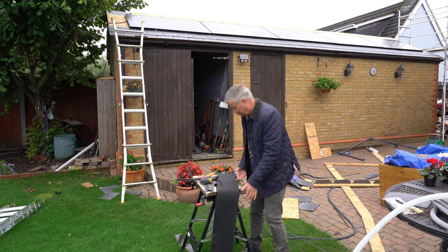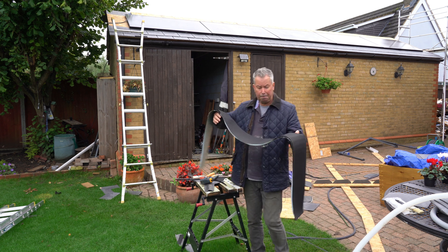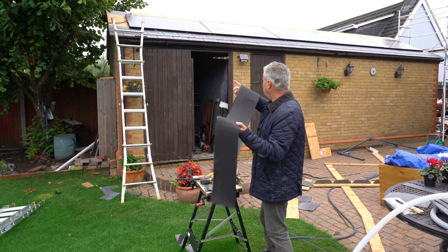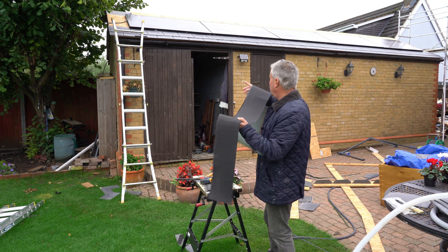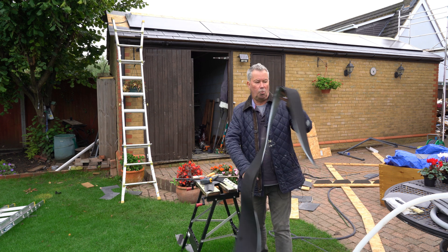What am I doing this morning? I previously cut this two meter length of EPDM, 180 millimeters long. It's going to slide into the groove on the panel up there and it's going to be then stuck down onto that layer of tiles, and then I will tile over the top of it forming a nice watertight barrier.